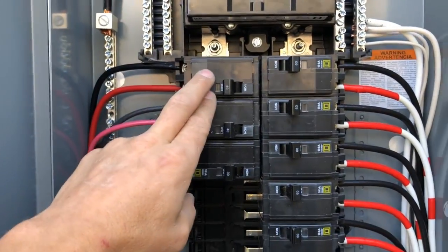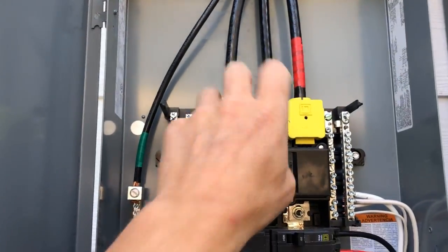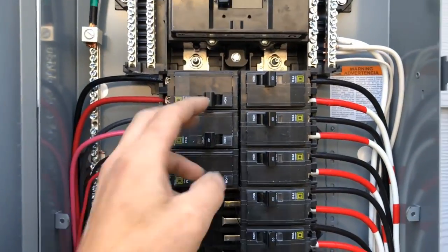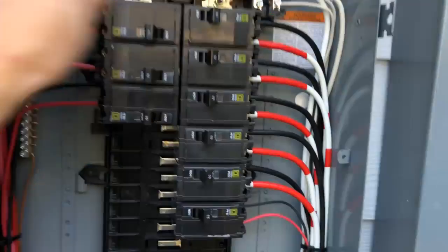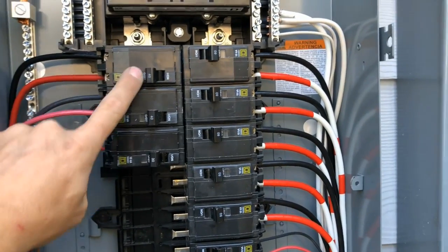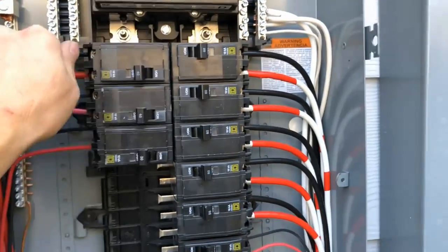But for some reason, if in that air conditioner there's a short, that short's going to make a whole shitload of current fly through the circuit, just like it would if we connected these two wires. If that were to happen, we would have an explosive amount of energy. It would catch things on fire and melt the equipment. So we put a breaker in that's rated at a certain amperage so that it can handle a short. When a short happens, this thing just trips to the off position. Because it's a 40 amp, it can handle up to 40 amps before it automatically trips and disconnects.